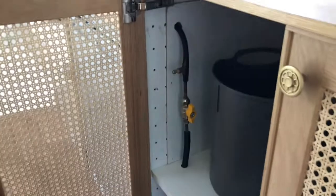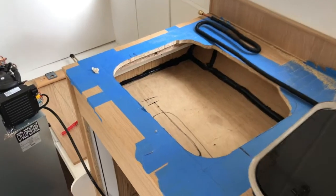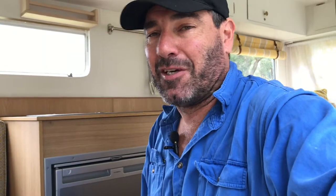There's also a little test nipple — that's a new regulation coming for hot plates; you need to have that. One thing most people don't know: if you have a hot plate installed over the top of a refrigerator, it's very important to have a vapor barrier installed. Underneath the hot plate there's a whole bunch of fittings and piping. Over the years if it gets rattled around and starts to leak, LPG is heavier than air and could drift down towards the top of the fridge — hitting the electrical components and igniting. The vapor barrier is quite hard to retrofit, but this one worked out well. I've used plywood sealed down with proper sealant all the way around. Most importantly, it's now compliant — if it ever does leak in the future, there'll be no exposure. That's the main thing: safe and compliant.